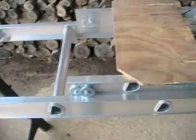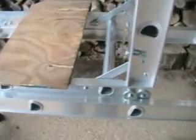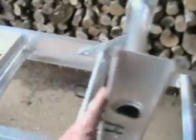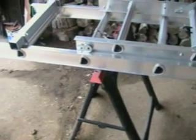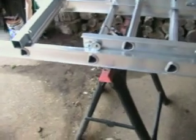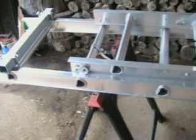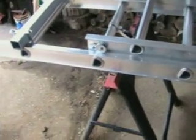There's another video showing a demo of this in action, but this is mostly for the assembly. This will roll all the way down within three inches of the floor and pull up. It's better to keep the motor at the top — first for security, since somebody could come in and if it's already down they could just climb the ladder and go through the hole. Also, with it all the way up at the top floor, you eliminate the chances of a child or materials falling through the hole.